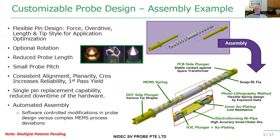One quick question from the audience for Karem: how would you clean these probes — what kind of cleaning method do you recommend? We have different recommendations depending on the tip style. For a flat tip, we usually recommend using an octagonal scrub method. And if you have a pointer or rounded tip for flat pad applications, we recommend using a Z-axis up-and-down motion for cleaning.